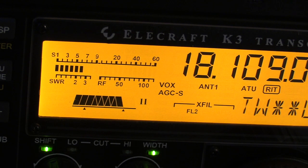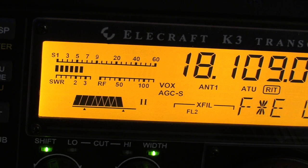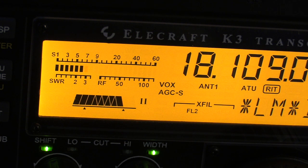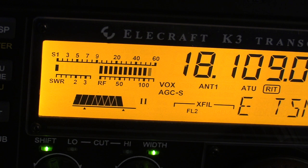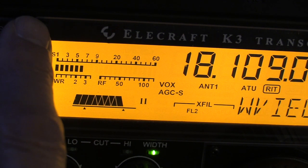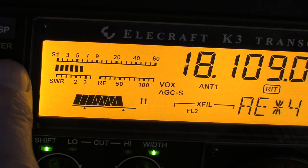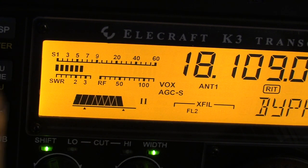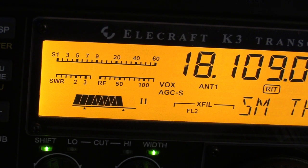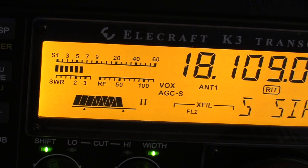Now just to show that there is no trickery here, I'm going to 18MHz. Now 18MHz is not a specified band for this antenna — it will work with an ATU. I'm going to press the auto ATU — that's tuned it. 100 watts and very little SWR, because the antenna has been matched with the auto ATU. I'm now going to bypass the ATU so it's no longer in circuit. All of a sudden we get VSWR on the left hand side of the meter, because there is no auto ATU switched in and the antenna is not specified for 18MHz.